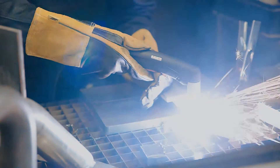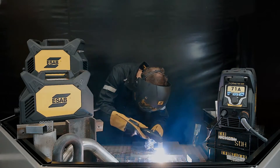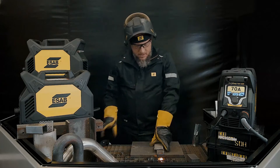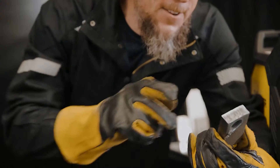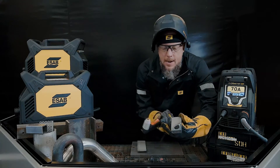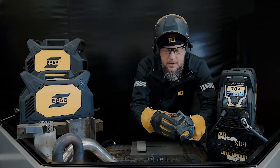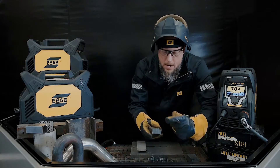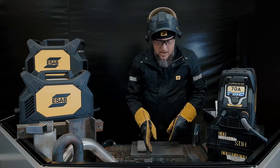Right through. Now I'm going to travel around the circle — circling back where I was to finish out that hole. You can see where the dross needed to go — it went that way and not onto my torch. So my torch stayed nice and clean. That's what that technique does for you: it allows those sparks to exit out at that angle and not right back up onto your torch. There's the pierce on the rated 20 millimeter piercing capacity.